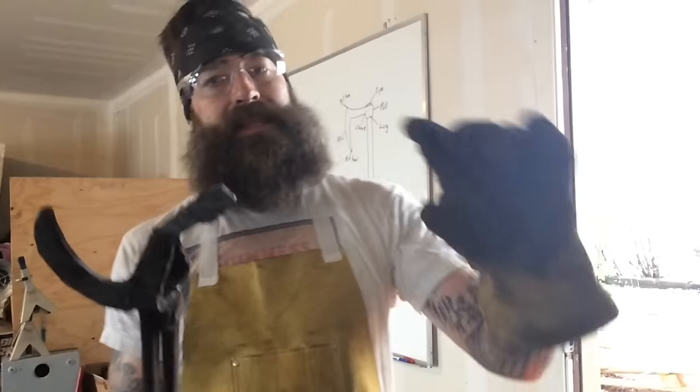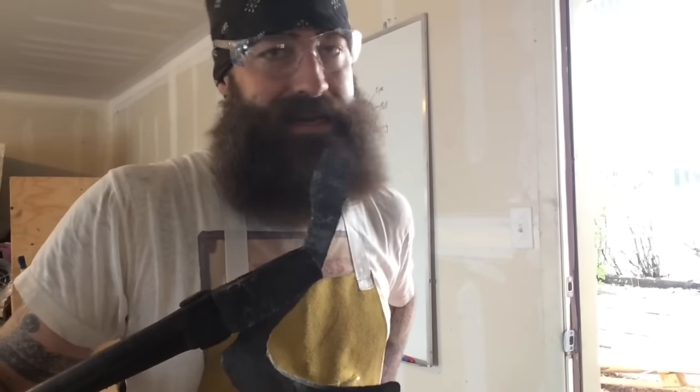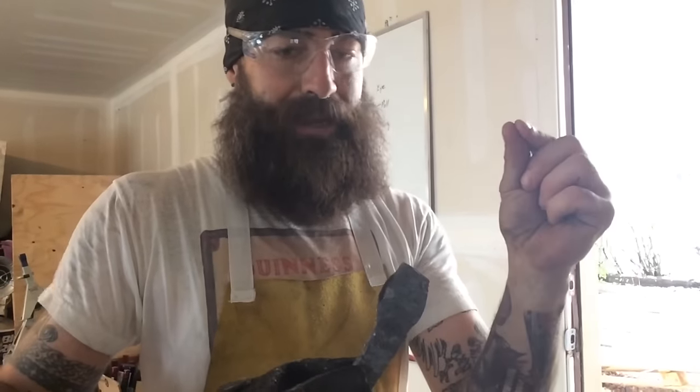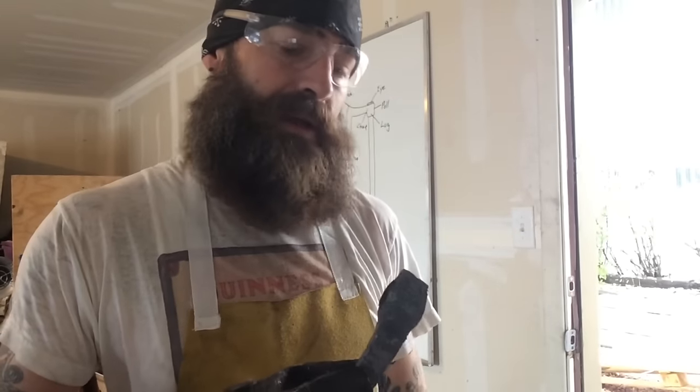All I'll have to do is get the axe handle a little bit more tight than it usually would be. And I don't think that I'll really compromise that much stability in it. And I'm not going to be driving it through an Englishman's armor over and over, so I'm not going to really need to worry about it too much. But I thought that just pushing the eye through the head of the railroad spike would make it easier, and it didn't end up doing that. Most of the time what you do in an axe is you draw it all the way flat and then you fold it over and then you forge weld your two lips together. But I thought that punching a hole straight through might make it easier, and it really didn't.